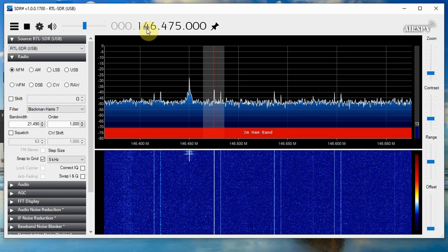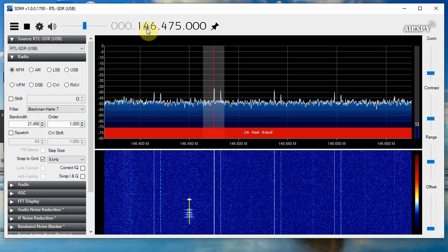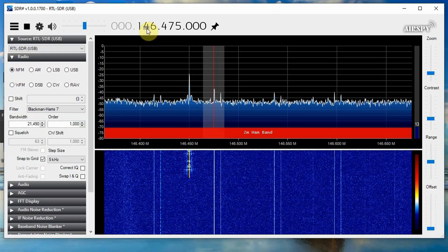There are really good Quick Start guides on the RTLSDR.com website — I would encourage you to take a look at those. There are also a lot of YouTube videos showing fun things you can do with your software-defined radio. One recognized shortcoming of the RTL-SDR dongle is that it tends to run a bit hot. I found that using a short USB extension that gets the dongle up and away from my laptop is helpful. I wouldn't use it in the sun or in an otherwise hot environment, and unplug it from the USB port when you're done. The RTLSDR website also recommends several other SDR dongles besides the one they sell — since they're based on the same RTL2832 chip, you can have confidence they'll work the same and be compatible with the same software.